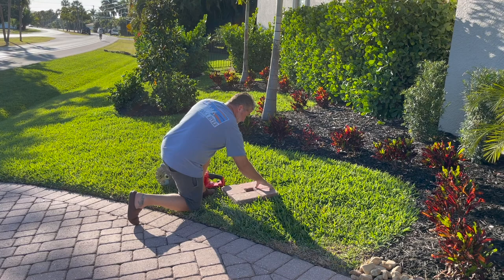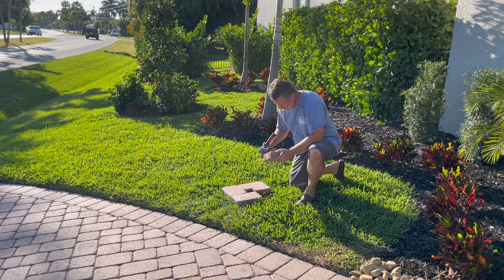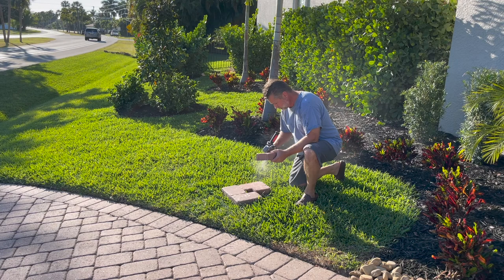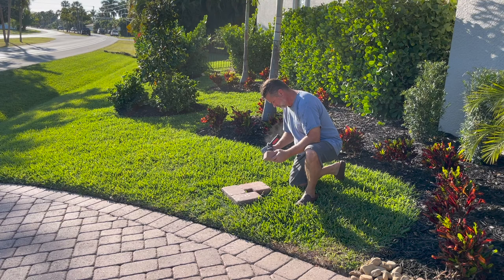There's the final design. What I'm doing here with a grinder is beveling the edge — when you cut the block there's a straight cut line, but these pavers are beveled on the edge, so I tried to reproduce that edge and make them look like they weren't cut and were naturally worn off around the edges. They came out really nice. I think this is a step you shouldn't skip; otherwise you end up with what looks like cut pavers that don't match the rest.